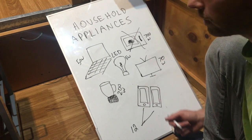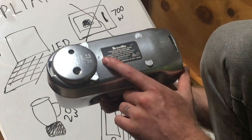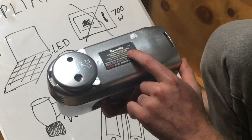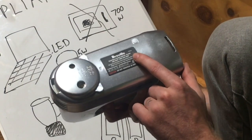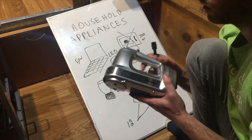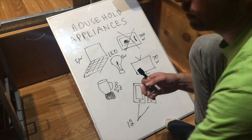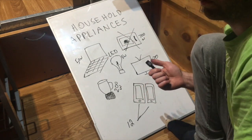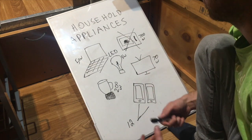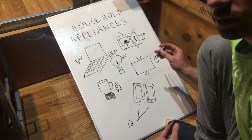It's pretty basic. Every device or appliance always has a label on it that tells you the voltage, the hertz, and the wattage. Wattage is key here. This device here uses 250 to 300 watts. This is really crucial when you're trying to pick out things for your off-the-grid system — what you think you'll need to ditch or what you can keep, depending on how big your system is going to be.